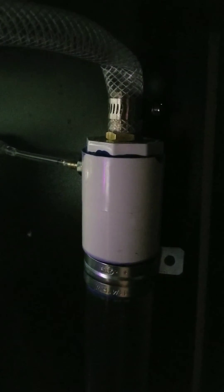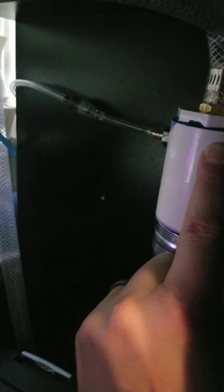Here is a reducer to a threaded piece, and there is a brass piece inside both ends. The part that goes into the PVC is threaded. This part up here is barbed to fit a 5/8-inch inner diameter reinforced vinyl tubing. It was very easy to do and it looks cool. You don't have to use the clear part, but I like using the clear part because you get to see the bubbles.